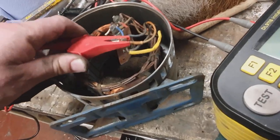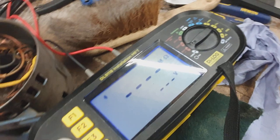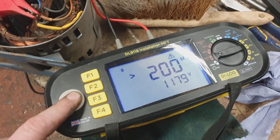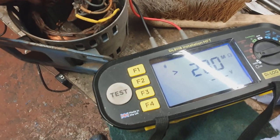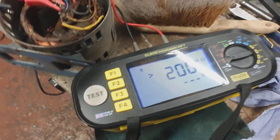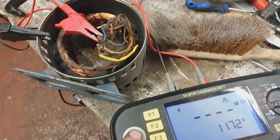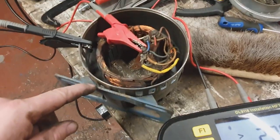Let's connect it up, turn the meter on, go all the way up to a 1000-volt test — and as you can see, we are now off scale, over 200 megaohms. And that's the same on all of the coils; these coils are all connected together anyway. But as you can see, to ground, to earth, it is off scale high. So I think I've fixed that.